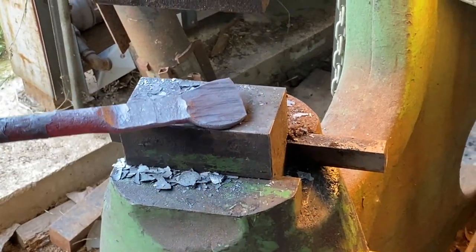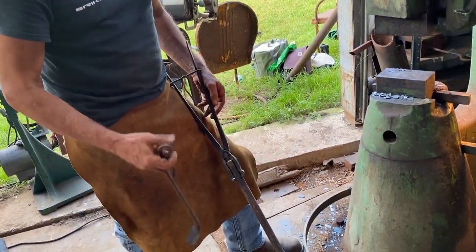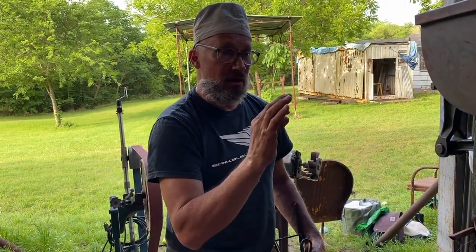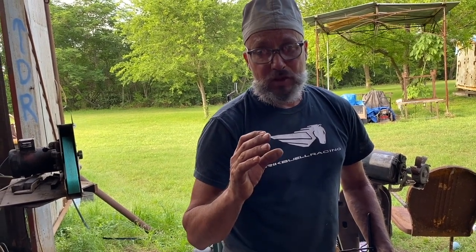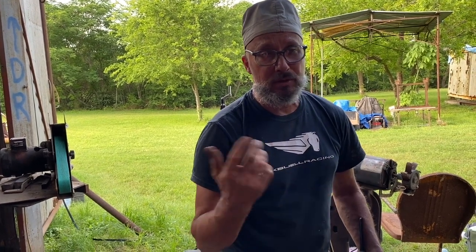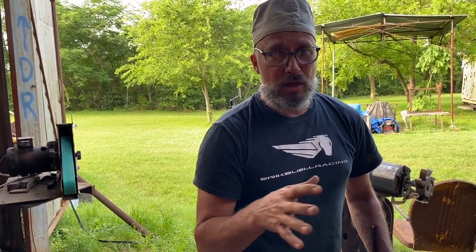So bottom line is, I just want people to think about how you're heating, how you're holding, and make sure you have good control over your steel, how you're hitting, and how you're developing power, but also the nuances of the faces that you're using. We talked about clay earlier and the specific type of clay. If you look at steel like clay, and it is very similar with the kind of power that we're developing, whether by hand or with the power hammer, then you can anticipate the direction the metal is moving. This is slow going at first.